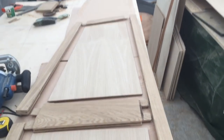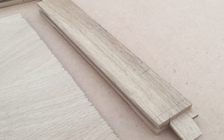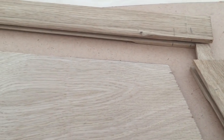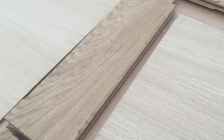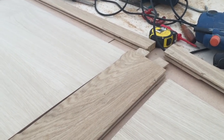The door's all ready now to be put together. There's quite a bit of work involved - when you first cut it out you've got mortise joints to do. This is a little mould I've just put on both sides. These panels are oak veneer on MDF - a veneer of oak with MDF. I didn't really want to use MDF on the boat, but it's very hard to get double-sided oak plywood. It's good stuff though and it has a nice grain on the oak.